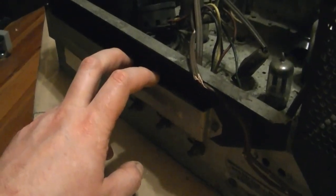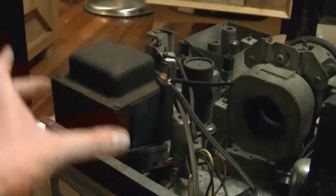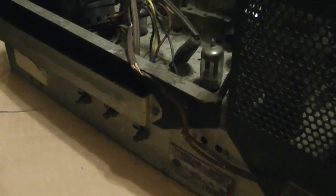voltage divider resistors, which is what's behind this. And the 630TS is behind a metal box up here. That's to create various voltage potentials that the set needs. So other sets like my Admirals actually have two rectifiers. A rectifier tube, like a 5U4 for say the main 350, 400 volt bus, and then a smaller 5Y3 rectifier for say the 125 or 150 volt bus.